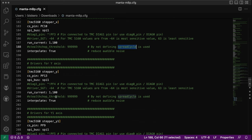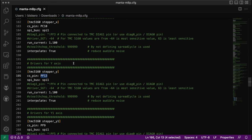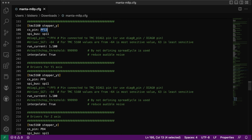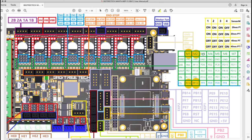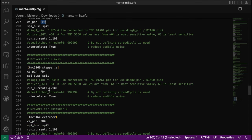For the Y axis, I assign this driver and the CS pin. Going back to the pin layout graph, M2 is my Y axis and the pin is PF13. So in the configuration file it's PF13. For my second Y motor, M3, the pin is PF9, so I set that in the configuration as PF9 as well.